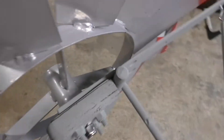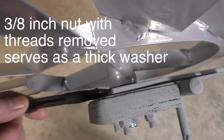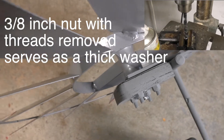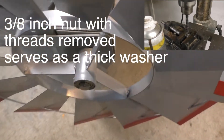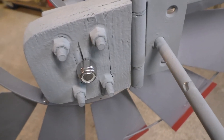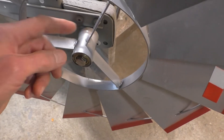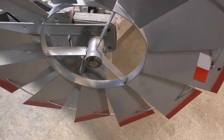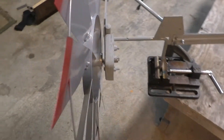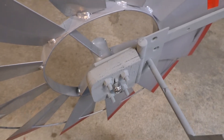On the back of the rotor I have a 3/8-inch nut — I drilled the threads out of that nut so it could go over the actual bolt itself. In addition to that, I have a nylock-type nut securing the bolt in place. Through experimentation I found these bearings don't like any compression or thrust-type force on them at all, so you need to let them float free.